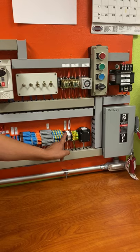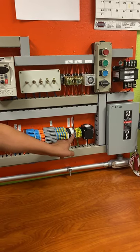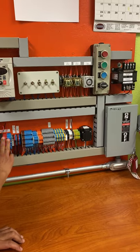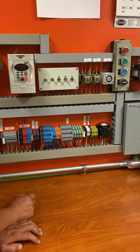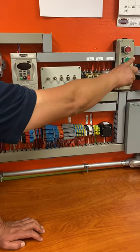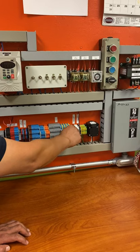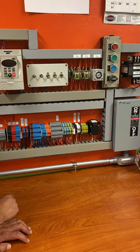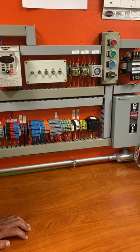This is what we call the transformer. This is actually the connections, these connections coming down here. That's your power for your 120 connection. This one is your three-phase connection. This is 208. This is your 120 connection for those. That's how we feed two wires from here to give power to this. So the transformer comes back out and hits right there. Every time you're going to be using 120, you're going to be coming out of these two wires right there. Again, you have your grounding. Of course, you have a 120 switch in case you need to connect something on there.